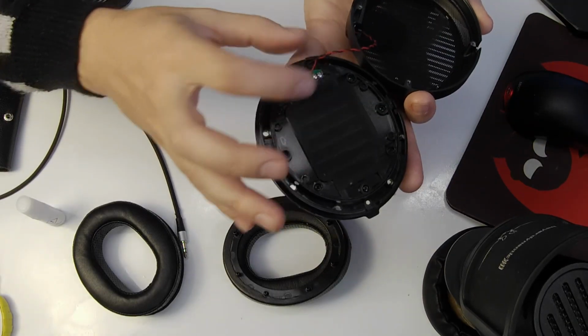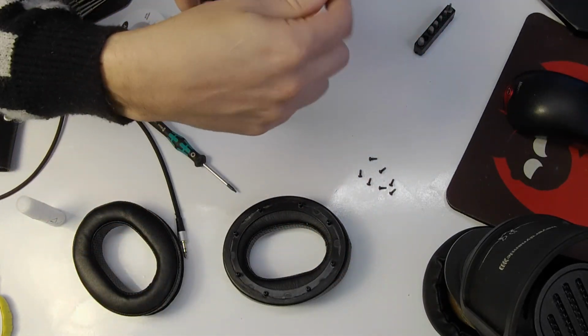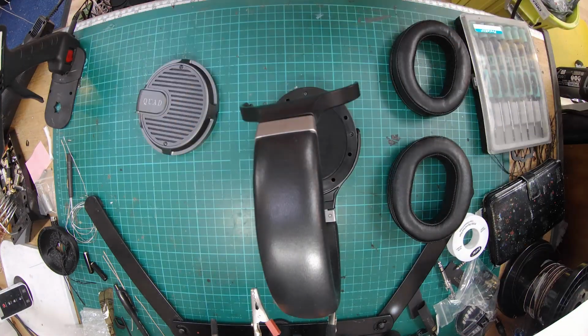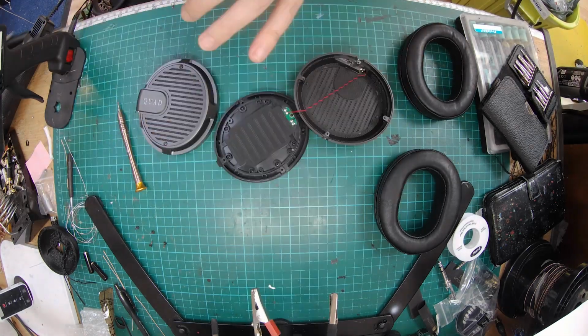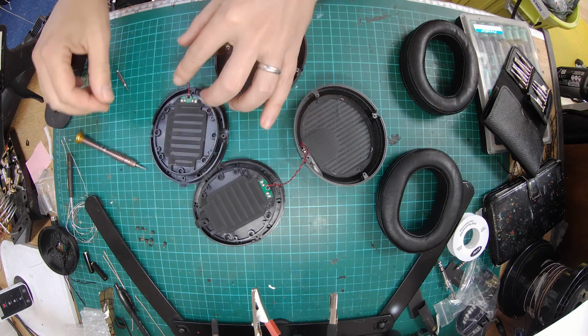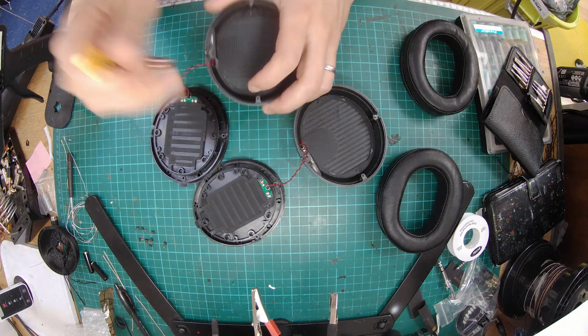Yeah, so there you can see where the wires are soldered on. It's very thin wires linking to the thing, but I suppose voice coil wires are also very thin. But your problem with the socket here is, I think, where it's moving around, you've just got a little grub screw in here. It was at that point I realised the actual socket itself was faulty, and I didn't have any sockets small enough, so I ordered the smallest socket I could find online in order to replace it. As you can see, I just had to mark up the positive side so when I unsoldered the drivers I wouldn't forget.